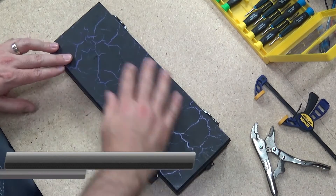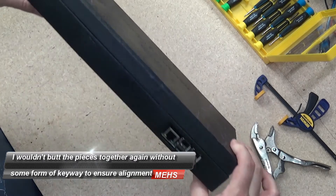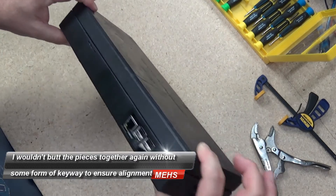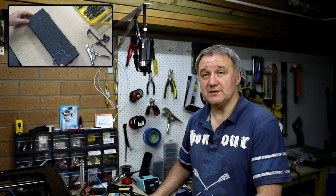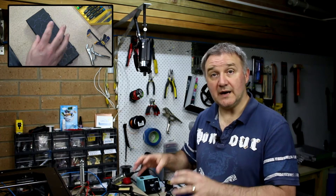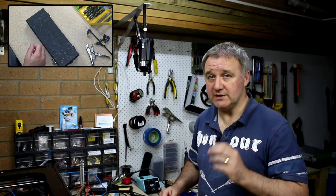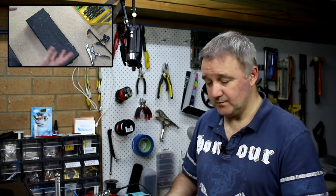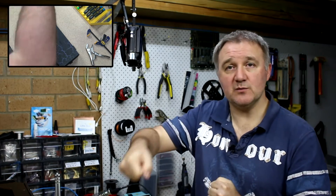That's the top part of the case there, so it didn't turn out too bad. I haven't finished all of the bits and pieces as yet. The hinges on the back are temporary — that was another learning curve. I printed hinges as part of the case design but they weren't strong enough; I went too thin on wall material. Even though I'm using Polymax PLA, which is fantastic, it wasn't strong enough to hold a 4mm bolt and lock nut to give the case rigidity.